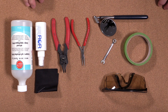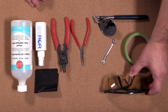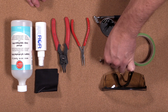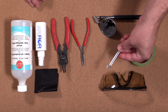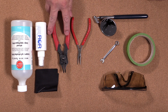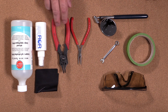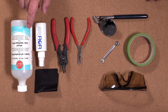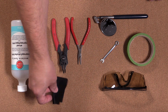Here's an overview of the equipment you'll want for this job. If you are aligning the mirrors on your machine, it's a great idea to be wearing some safety glasses that are rated for your machine. You'll need some masking tape — most types will do. You'll need a combination wrench that'll fit the locking nuts of your adjustment screws for your mirrors; mine happens to be 5mm. You'll want one of these mechanics mirrors, and either some very fine tipped pliers or some ring clip removal pliers — having both will probably come in handy. You'll want some sort of liquid to clean your lenses and mirrors with; I'll be using photography lens cleaner, but a lot of people recommend using rubbing alcohol. And last, you'll also want some sort of chamois to wipe your lenses and mirrors with.